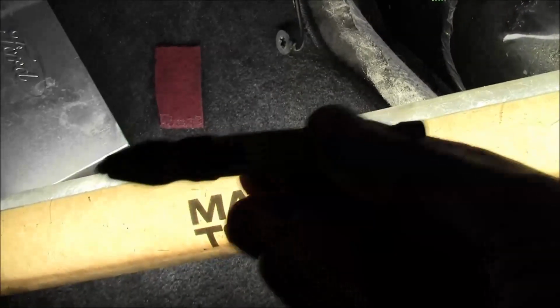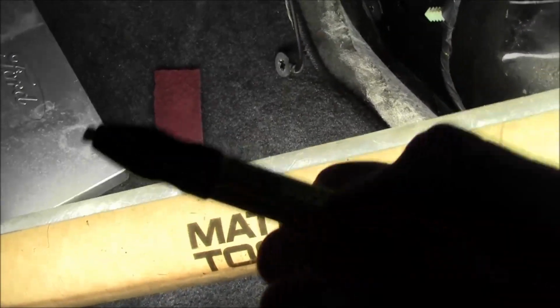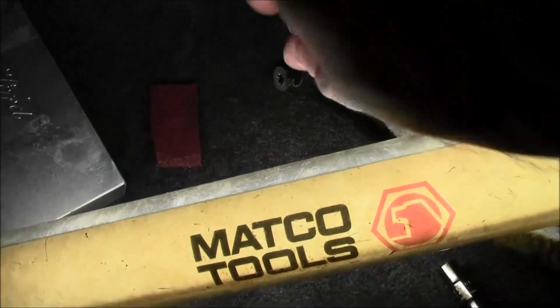Alright guys, so just like the white car, the ground is kind of ramming in the seam sealer. This one isn't as bad as the white one, but there was still paint on there, so I just use that prep pen again. This thing's pretty handy. I'll probably get a link for this for you guys in the description. Works out really good for stuff like this.